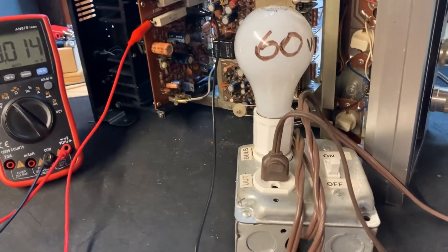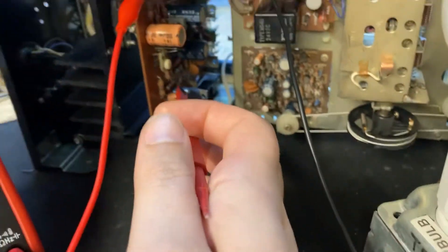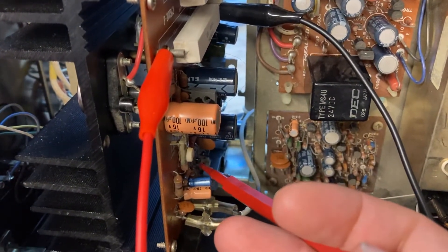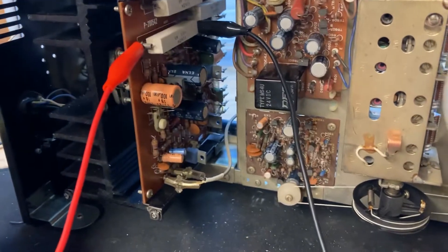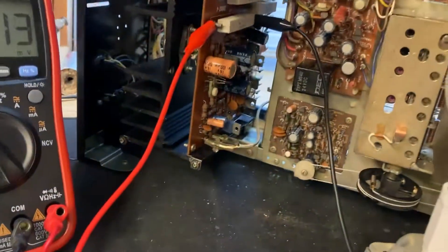So I'm gonna start it up and let's see if we can narrow down what's happening. I have a suspicion that right here — I don't know if you can see that — we've got a little diode, a little black blob looking thing. That's a dual diode right there; they're kind of notorious for crapping out. I've got my freeze spray here so we're gonna try and get it to act up.